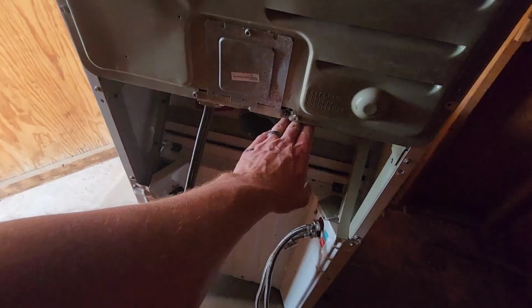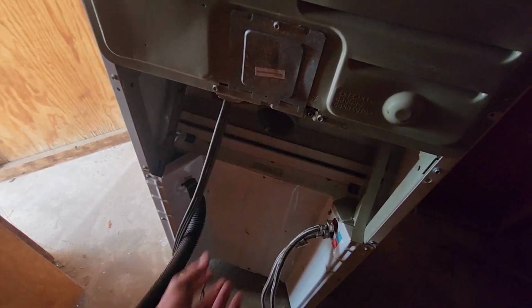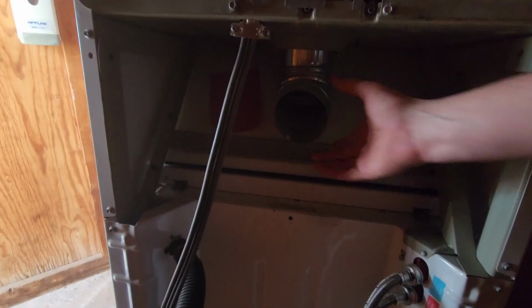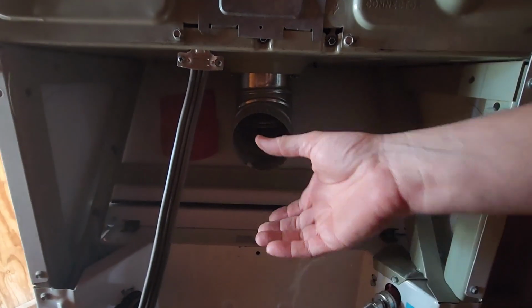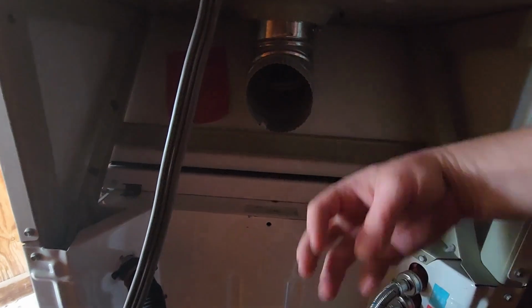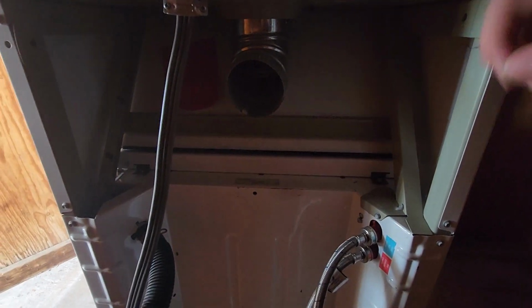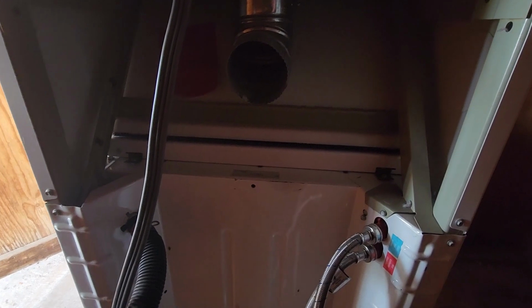But then this will kind of set the height of our washer box and where the dryer vent comes through and all of that. So I mean, you can see there's the existing, that's the out from the dryer, so I want to put the out to the outside of the house close to that same height, and make sure that the washer water hookups leave us a nice loop, and then we can hook up. So they'll all be very close to the same height. That's the goal. I'm going to check out where the plugs need to be, take a few measures, and we'll get after it.